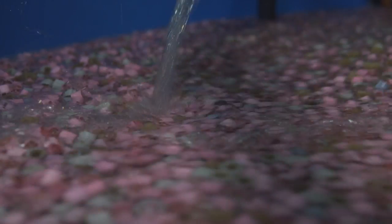After passing through certain filters, water flows by gravity to the lowest point of the system. The lowest point may be located after the drum filter, after the biofilter, or at some other point in a non-standard RAS system. From this lowest point, the water must be returned back to the RAS. This is where the pumps are installed, operating for constant water circulation in the system.